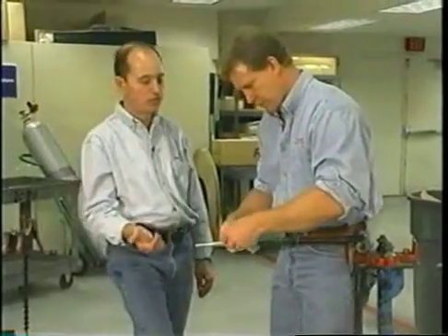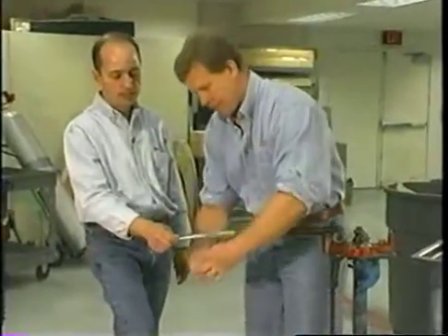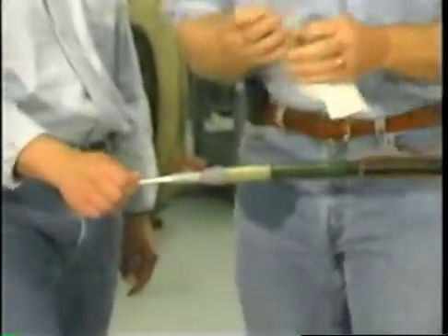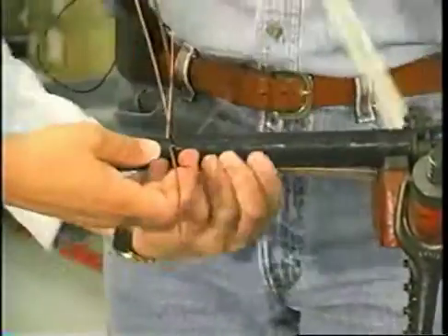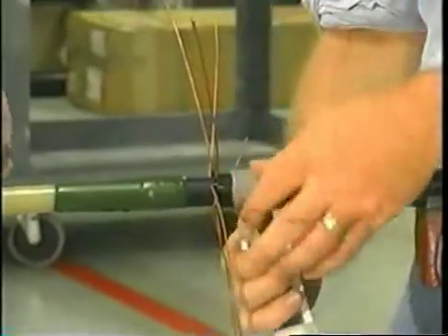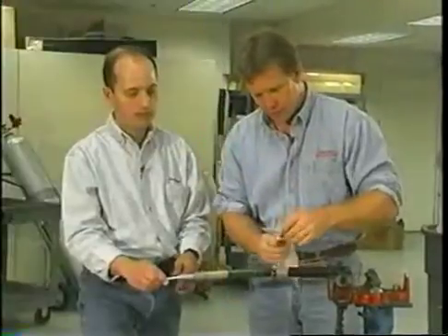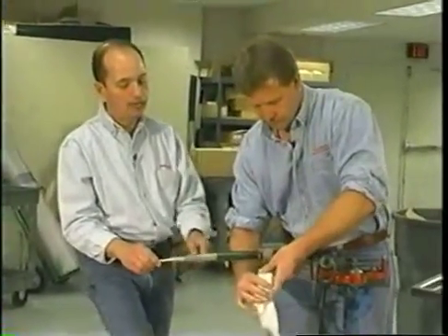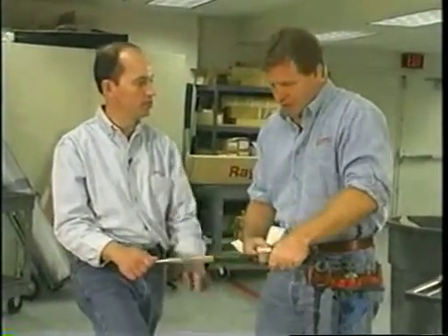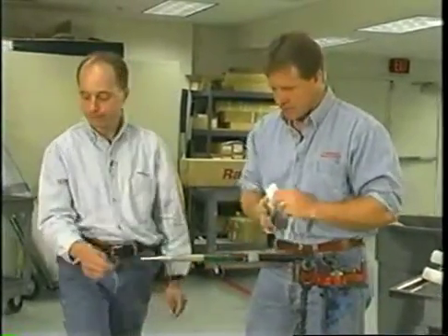It's very, very critical. It's important that the stress control is placed in the proper position. So here you know where it is, it's making contact with the semi-con, and it's not moving around. Okay, this is just a mastic, a gray mastic. I'm sure it's suitable for outside, non-tracking. Yeah, we're simply taking a sealant mastic, wrapping it around, and building up a moisture barrier. In this case we're sealing underneath the neutral wires and then on top, so you sandwich the neutral wires between layers of mastic. And I noticed that when you installed this, you didn't put a little bead of grease at the semi-con cutback. There's no need for that with this stress control patch, because the patch actually fills in the area at the semi-con cutback.